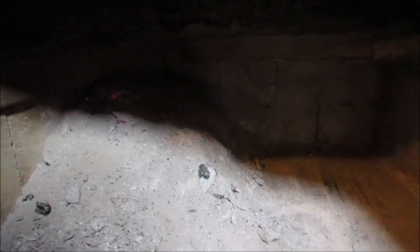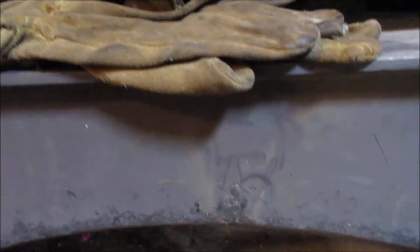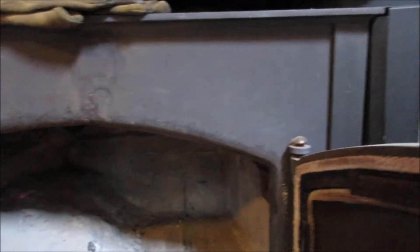What we've done is let it burn down and covered up all the coals with ashes. I have to reach in here and take that baffle down. There's a baffle that goes across, and then the flue goes up above that baffle. What I've got to do is put my chin on there, lean in, and grab that baffle with my welding gloves, and get it down on the bottom.